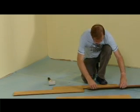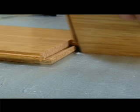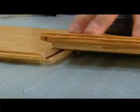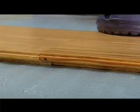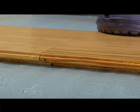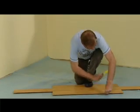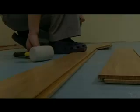Second converse panel. Position the low hook on the long edge of the second converse panel onto the up hook on the long edge of the previous row panel, and the up hook on the short edge parallel to the low hook on the short edge of the first converse panel. Then use the rubber mallet to tap the up hook joint area along the long edges until they click in together. Repeat the second panel installation until the conversely installed panels are finished.